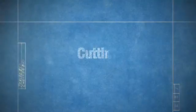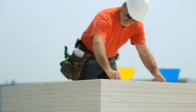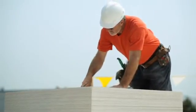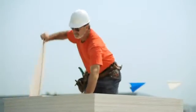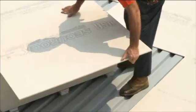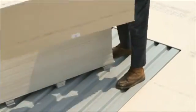You can also use low-rise foam adhesive or hot asphalt when attaching. SecureRock Gypsum Fiber Roof Board is easy to score and snap — there's no need to score both sides or use your knee to break the board, and you can cut it on the stack, on your cart, or on the deck, which can be a big time saver over a large job. For straight cuts, use a utility knife to firmly score or double-score the board depending on thickness, then place your hand along the line, grab the edge, and pull up or press down.